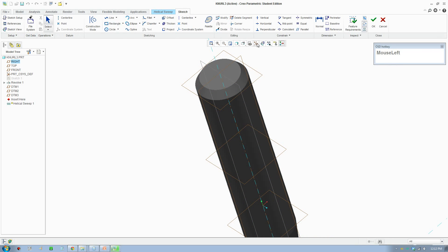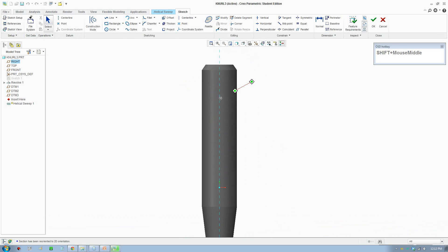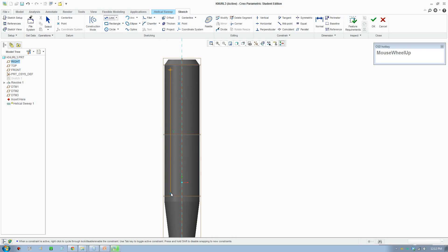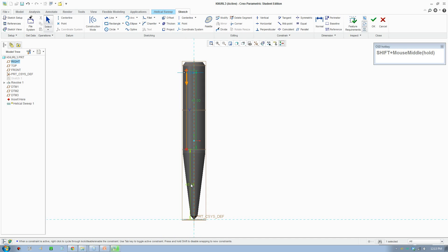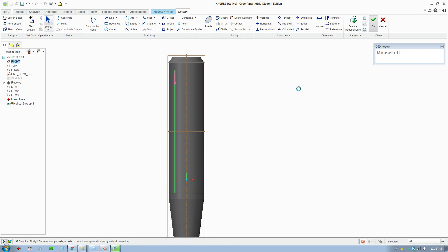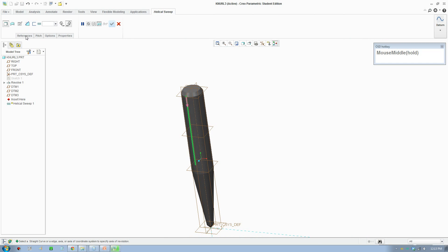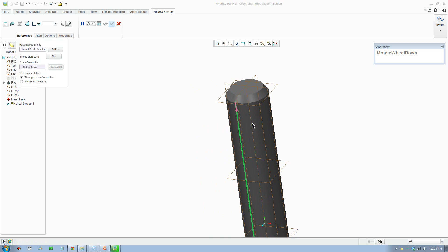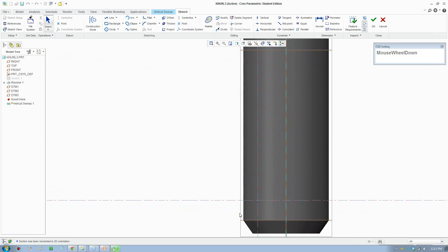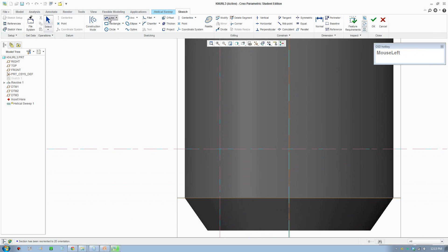I clicked on the side plane, bring the plane forward. The first step is to create a direction for your sweep, so we're gonna create a sweep 45 millimeters long and 40 from the bottom. We need to define the length and direction of the sweep. After that we go in and pick the center axis of revolution.